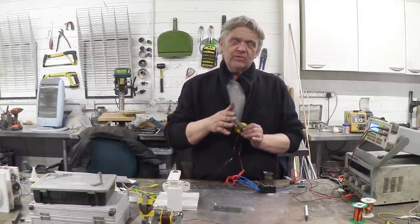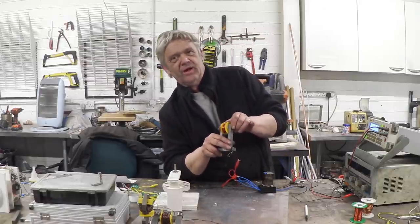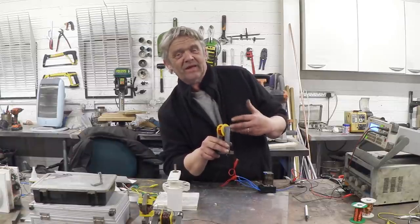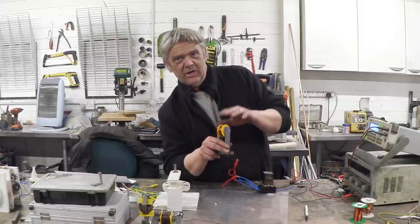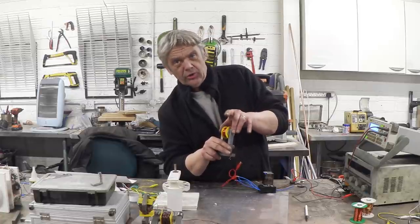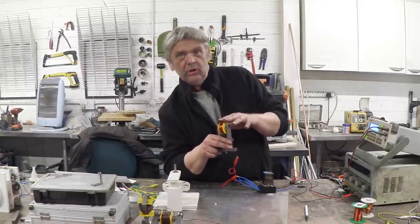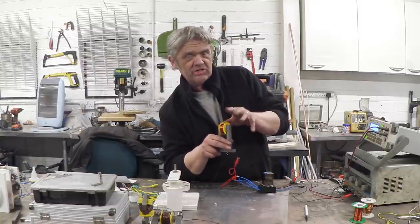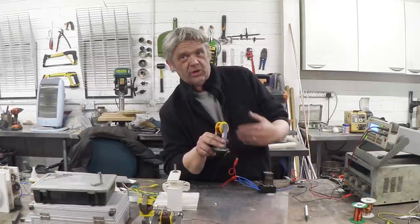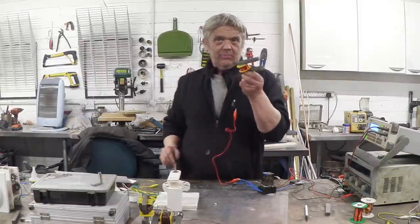I was asked whether the way I made these makes a difference. If you look at video 1036, we did some testing on the effect of magnetic assistance versus a plain electromagnet — because this isn't just an electromagnet, it's a magnetically assisted electromagnet. When it's on, it's stronger than the coil by itself. With just the coil it used quite a lot of amps for a reasonable amount of strength, but when magnetically assisted it's an awful lot stronger for less current. So the magnetic assisting really works.